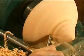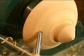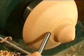Raise the tip up to keep the bevel on. The moment the bevel leaves the wood, this cut will catch. Cuts like this can allow you into tricky corners that wiser men than me might avoid. For removing quantities of wood, the gouge may be used tip against the wood and cutting on the side. From underneath like this, you will notice that in front of the cut the bevel is engaged by rolling the tool, where the traditional grind requires a swing. The roll is the key to the quality of cut with this type of gouge.